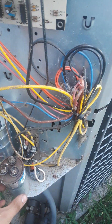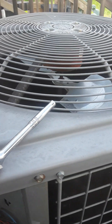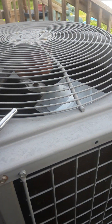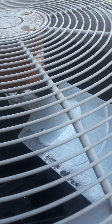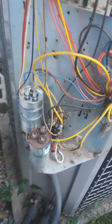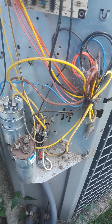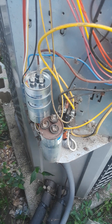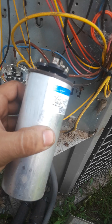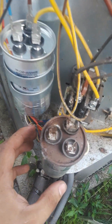I'm changing the capacitor on my AC unit. I was able to turn the fan by hand with a screwdriver and it slowly caught up to speed — needless to say, the pump wouldn't turn on. I knew the capacitor was bad. If your AC unit goes out or stops cooling down during the summer, it's most likely your capacitor.